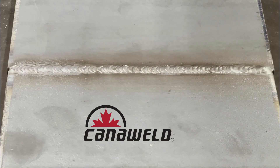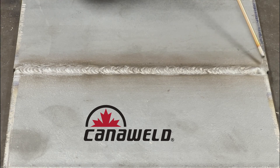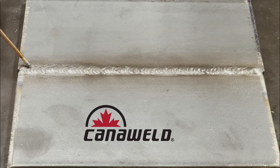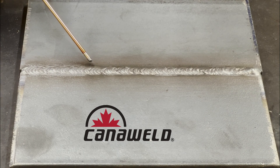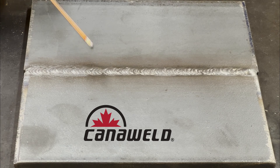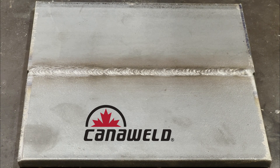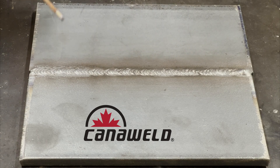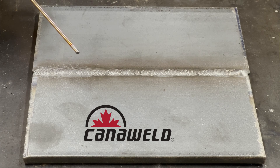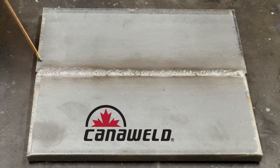Okay, so we actually ended up running this bead three times, and we're going to have some tinted and untinted footage for you guys. Here it is — came out pretty good. I actually thought it was going to be dirtier because I couldn't get all the mill scale off and I really just gave it a quick wire brush, but that's not bad at all. Ran really smooth with the foot pedal and putting 150 on the dial for amperage was absolutely the right choice. I could pretty much bottom out the pedal with just a little bit of space left if I needed it, and it felt really good and smooth — I'm happy with that.